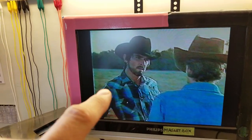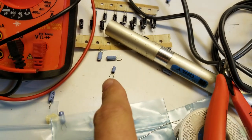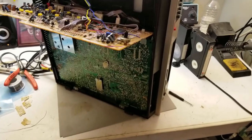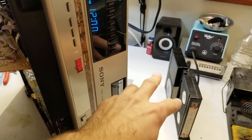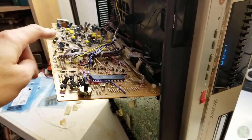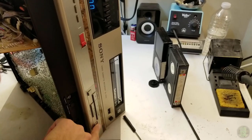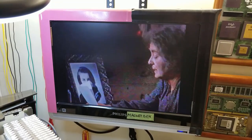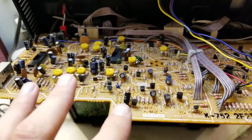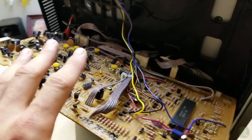She's working beautifully now. Tested Beta 2 and 3 so far, haven't gotten to Beta 1. Adjusting the freewheel speed - if I play this Beta 2 tape, the freewheel is a pain in the butt but I think I've got it pretty good on Beta 2 and 3.